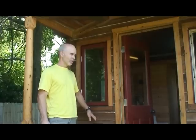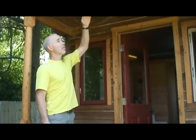For the outside of my house, I chose to use as many reclaimed materials as I could. This being South Louisiana, cypress is the #1 choice. It's long been used in this area for its rot and insect resistance. But the siding is all antique cypress, removed from old buildings in the area, most of them over 100 years old. A lot of the trim and structural supports are antique pine, again removed from buildings and barns in this area. Let's take a look at the inside.